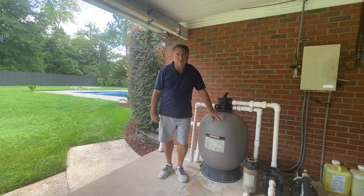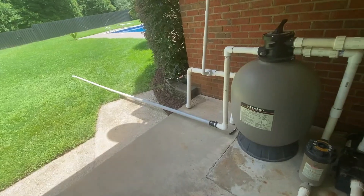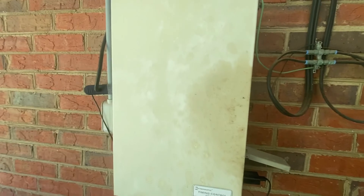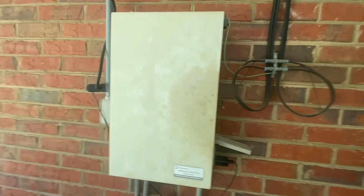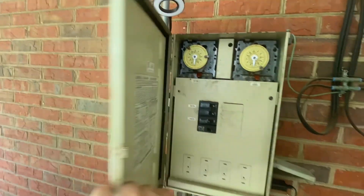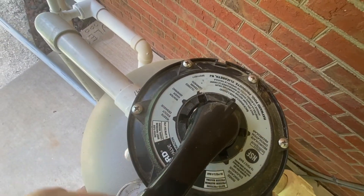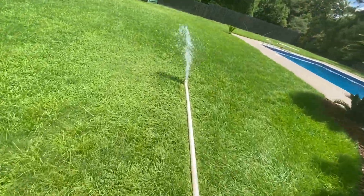First I'm going to add my drain, and then I'm going to turn off my filter pump. A word of caution with any kind of breaker box: ensure that you're not standing in any puddles of water when messing with any type of electricity, and also make sure your hands are dry. I'm going to open up the panel and turn off the filter pump. Next, I'm going to select backwash — I press down on this and rotate it counterclockwise to backwash. Now I'm going to turn the filter pump back on, and then water will start draining out of the pool.